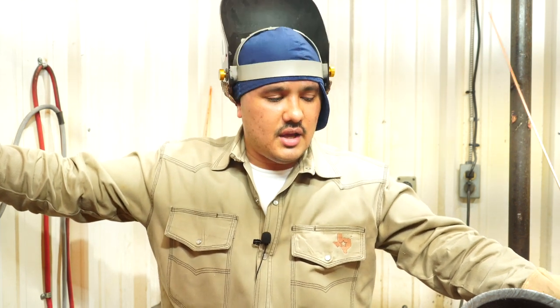What we tell our guys, we usually tell them to run with the 3/32 rod just to make sure you're fusing properly onto your root pass. They're running about 140, 150 on their hot pass. As you get better, you can move up to a 1/8 rod, but just make sure you're running hot enough to burn that rod properly. And stay out of the middle. You don't want to stay in the middle too long when you're running hot. You stay in the middle too long, and that'll give you a lot of heat, and then you'll suck back that root.